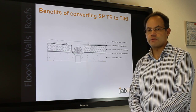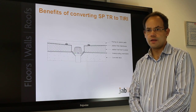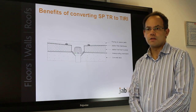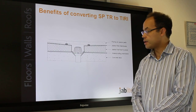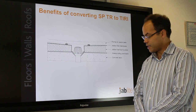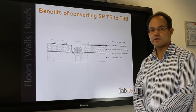Tapered inverted roof removes the need for screed and is a cost-effective roof drainage solution. The tapered profile prevents rainwater — whether in liquid or vapor form — from flowing through the gaps in the insulation. Tapered inverted roof gives you the slope without the need for investment in costly structural changes and allows for a simple drainage arrangement.